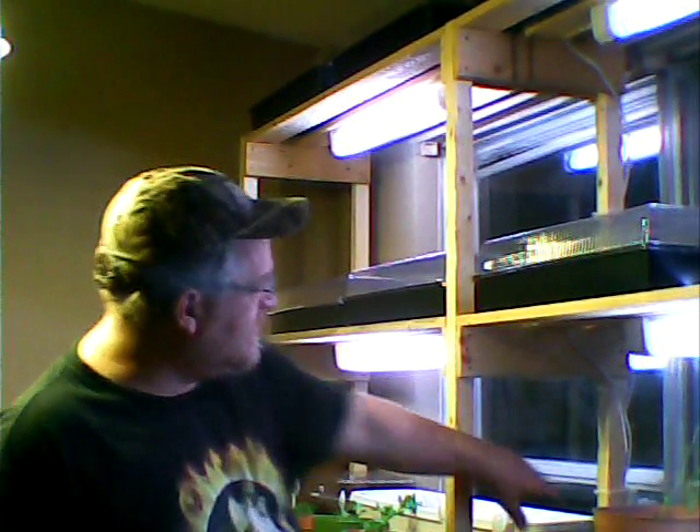What we've got is six lights — they're 17 watts apiece. If you want to figure out your amp draw, you add up your wattage and divide that number by the volts you're using. These are 120-volt lights, so you take 102 and divide by 120, which comes out to 0.85 amps. This particular circuit is on a 15-amp breaker, so 0.85 is very little use for it. It's also on a power strip with thermal breaker protection — you may have to replace the fuse on some. So your amp draw is really low; it's efficient and it helps with the lack of sunlight we have here.